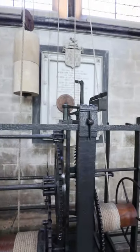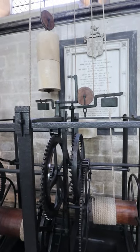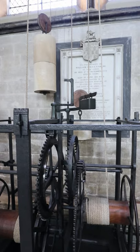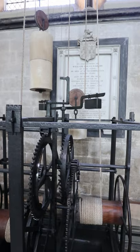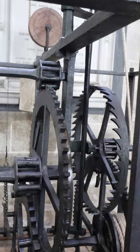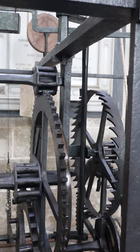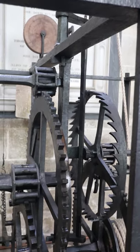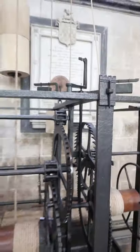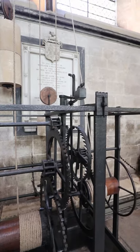We actually have a double-weighted pendulum on the top, and as that swings back and forth, that's the tick-tock action — about four or five seconds for each stroke. You can see there are little ratchet teeth that grab the teeth on the escapement gear, preventing it from just unwinding really fast. The momentum of those weights swinging is a controlled way to slow down the movement of that gear.